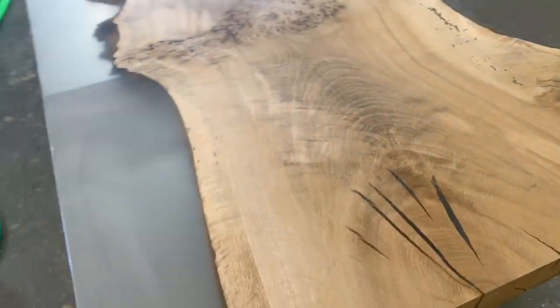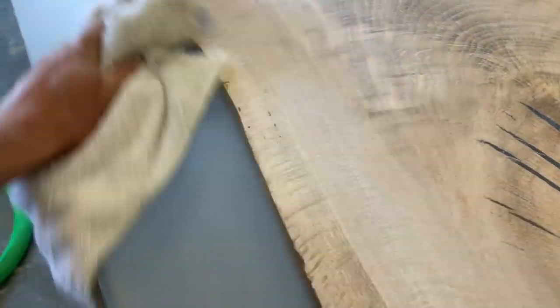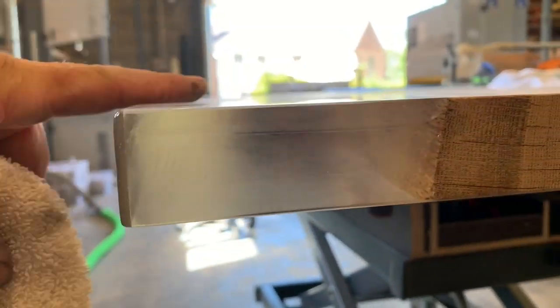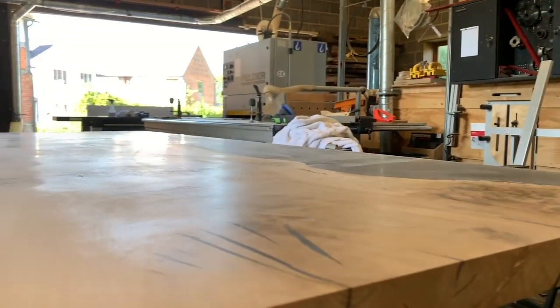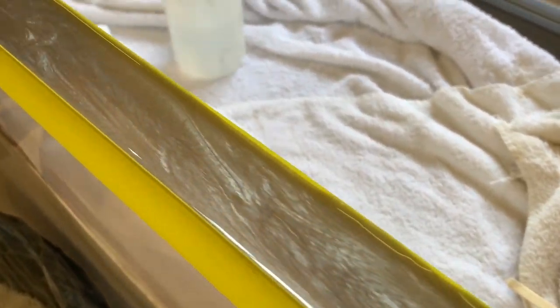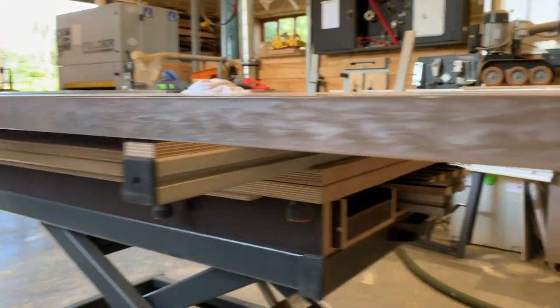Still working on this table — the base is finished, but I'm experimenting with some polishing. I've just made it matte again; it was completely clear and I'm still not sure about that look. What I have done, which I'm loving, is I molded it in two goes — a pass on the top and a pass on the side. This is the gray metallic with black; people keep asking and I do mix it myself using individual pigments — black and silver metallic. I turned the table on its side and recast some GlassCast 3 down the end, and I really, really like how it came out.